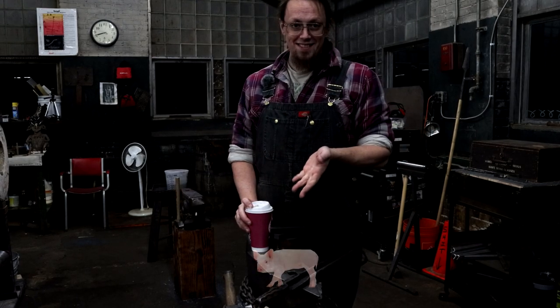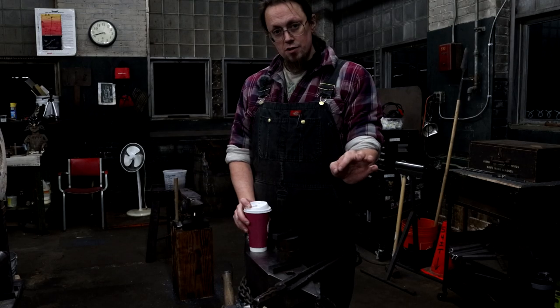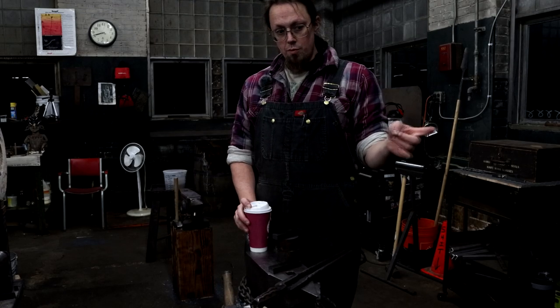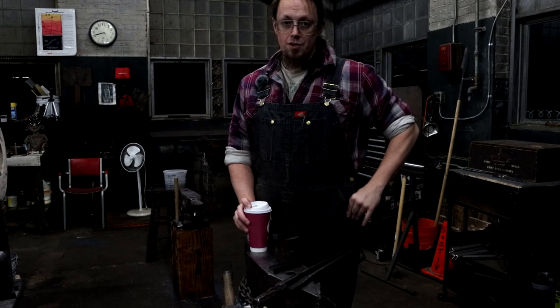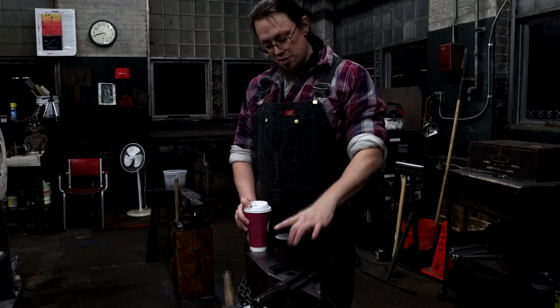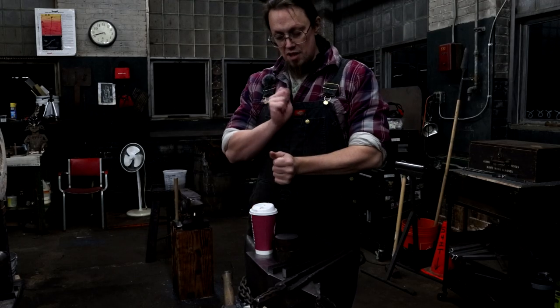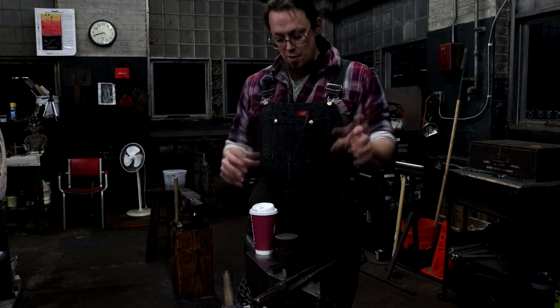This is a hammer. I'm gonna make a hammer for chasing and repoussé and for raising, so that I can raise the 3D form that I want for the scabbard shape, the little squid head. I'm making a raising stake for the same reason. That'll go into a vise, and then I'll use the raising hammer to raise the shape that I want.